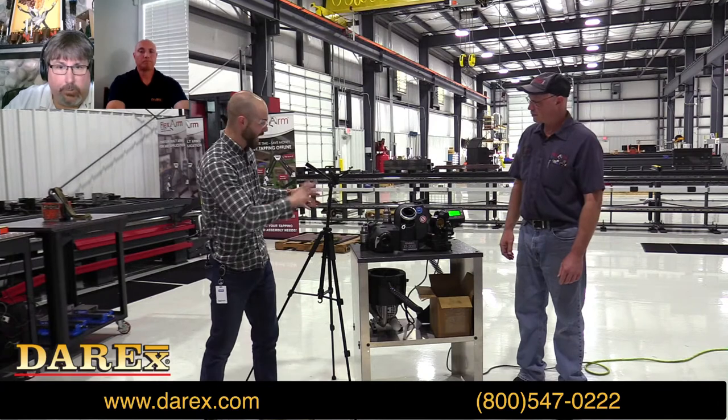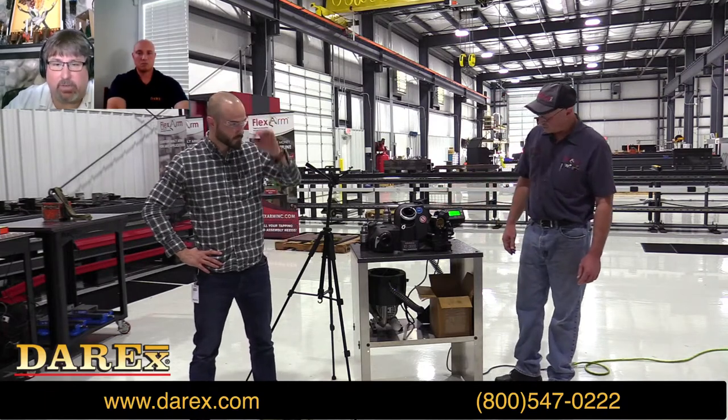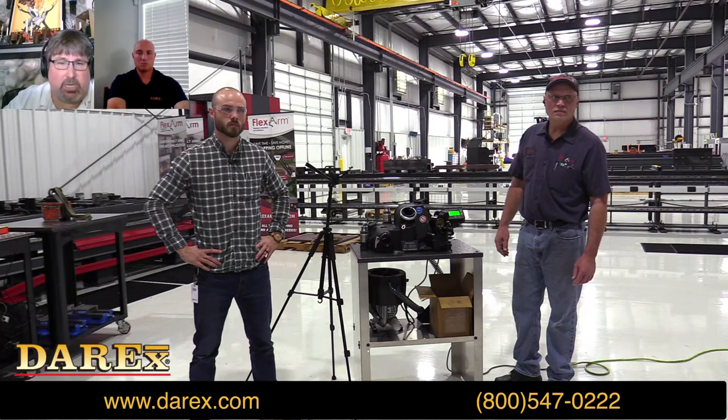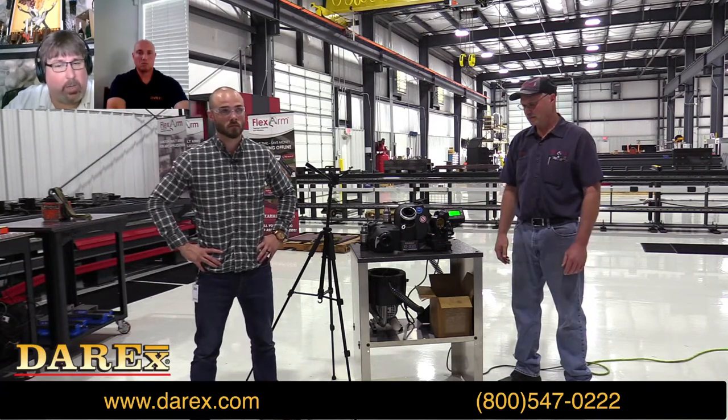A question I had: are there any accessories you'd recommend for general applications on this machine? We very much encourage customers to buy that vacuum — it's continuous duty rated, HEPA certified, and it runs automatically with the machine. The stand, the vacuum, and the machine can be sold as a package with a promo price. And if you buy that vacuum component, we extend the warranty an additional year on the machine. Without it the machine gets pretty dirty quickly, but with it it stays remarkably clean as you exhaust all that grinding swarf as you're producing it.